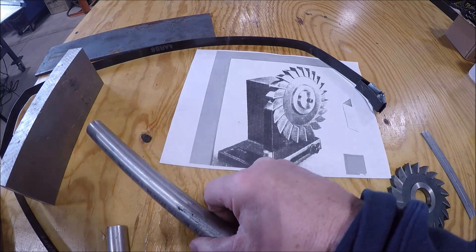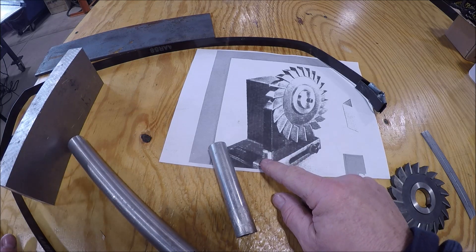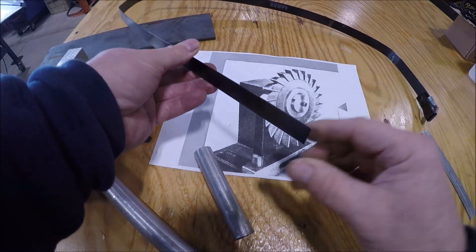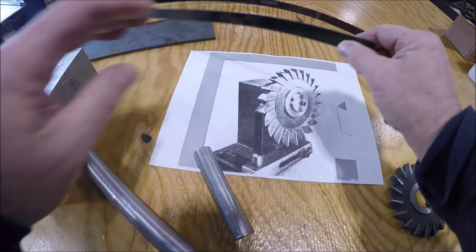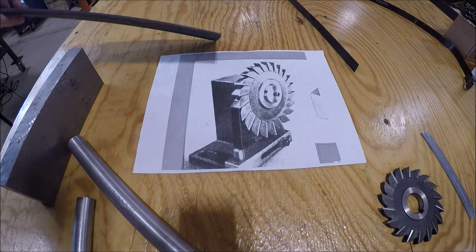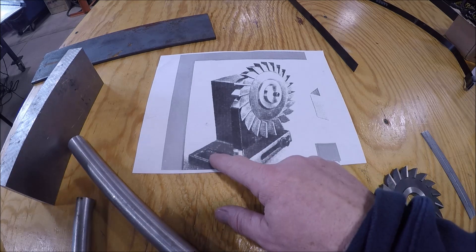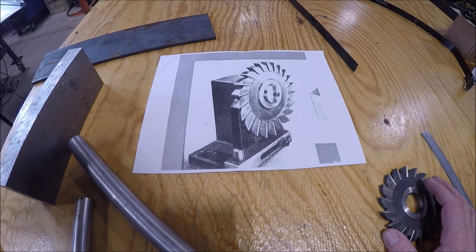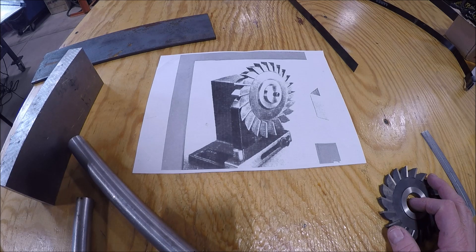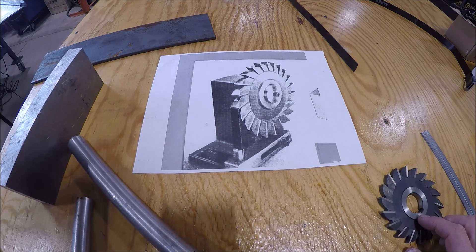For the occasional sharpening I'll do, aluminum will be fine. I've got another piece I can use to make the fixture to hold the finger, and we've got some strapping to make that finger out of. The only problem is you can't mag down aluminum, so I've got this piece of plate — probably hot rolled A36 — that I can put on the bottom of the base so it'll clamp down. We've got some milling, a little drilling, a few holes to tap, and probably some lathe work. Let me get over to the bandsaw, cut the stuff down to rough dimension, and meet me over at the mill.